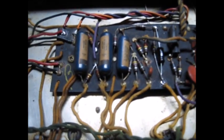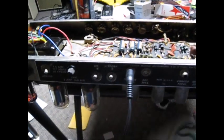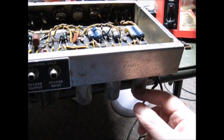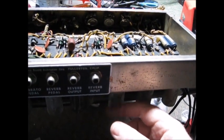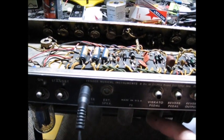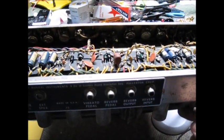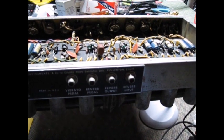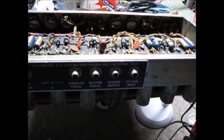We're going to kick the tires and light the fires. The preamp tubes in here are all Silver Tones and Radio Shacks - nothing exciting - but the power tubes are actually good, they all tested okay. So we're operable, biased according to what Fender says from the factory, and our rectifier is rectifying. But with no volume right now, listen to this - we've got the most microphonic train wreck of tubes. This one's blatantly obvious. Junk tubes - those Silver Tone and Radio Shack tubes weren't impressing me and they're still not.